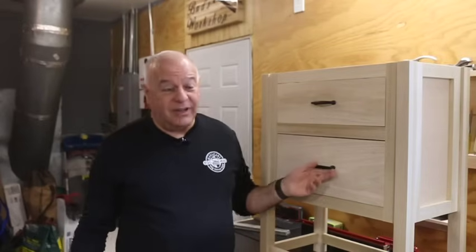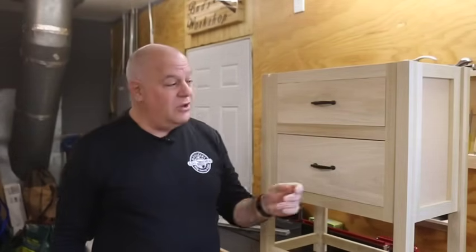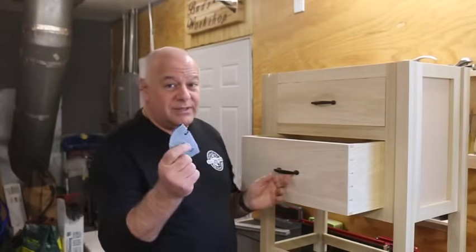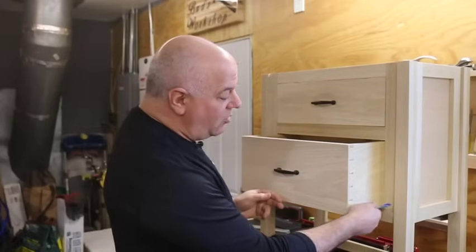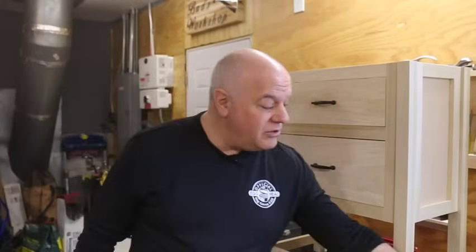So there you have it — as you can see, these slide pretty smooth. If the drawer doesn't slide easily, the first thing I would do is take a piece of sandpaper and sand the bottom corners just to make sure you have no sharp edges on the drawers that could be grabbing the runners. The second thing you can do is get some finishing wax and apply it to the runners as well — that'll make them nice and slippery. I hope you liked this video. If you did, hit the like button and subscribe to my channel so you get alerted when I have new videos come out.